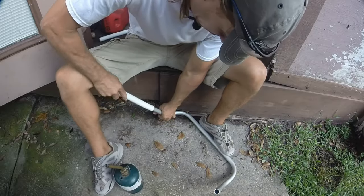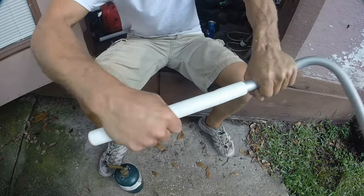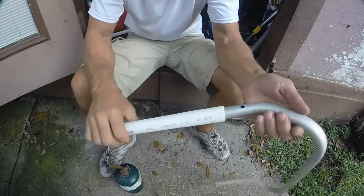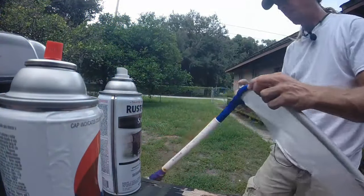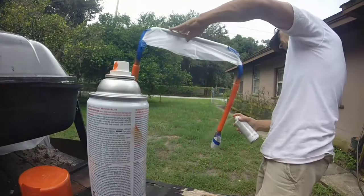That's a piece of three-quarter inch PVC. It wasn't big enough to fit over that aluminum pipe, so I heated it up, slipped it on about three or four inches until it cooled, and it was on there really good. I added my little paint touches to it. I'm growing fond of this technique — it's fast, easy, and looks pretty cool when you're done.